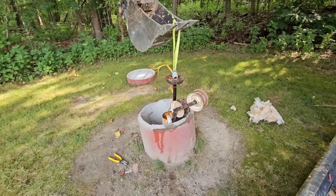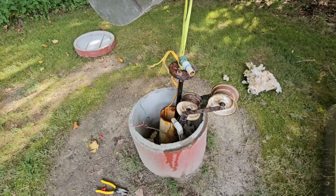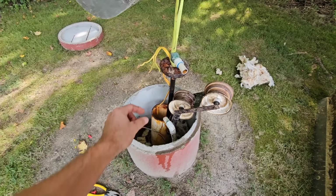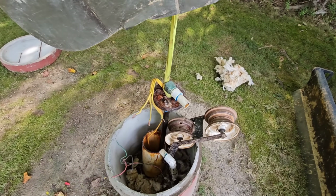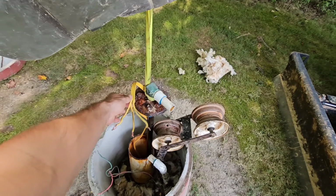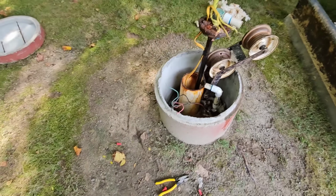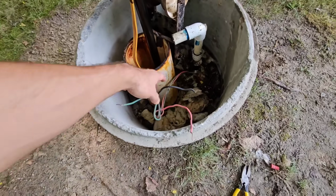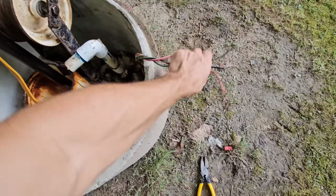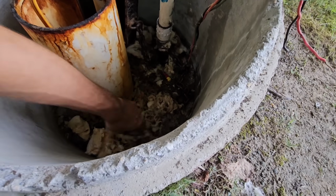At least this thing's probably in 180. At the most, it could be in 400. I'm just looking at the thickness of the casing, the metal well seal, brass 90, and the 900 and some foot says on the wire. Homeowner does not know any information about how deep the well is. I just assumed other guys felt like it was deep and they didn't want to mess with it.